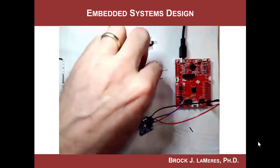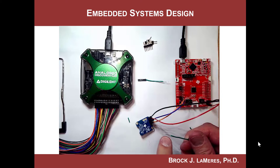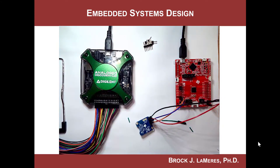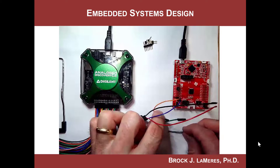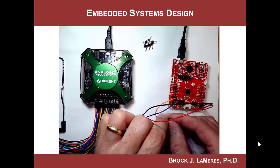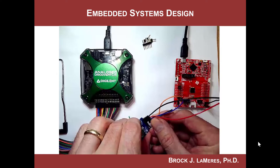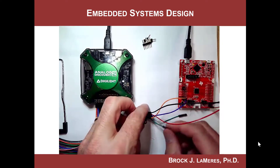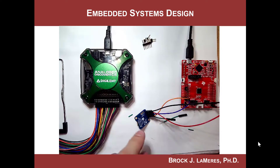Now I've got these two wires with their leads exposed. I'm going to plug them in along with the data and clock lines. Go ahead and twist the wires — they're actually multiple conductors — to make them a little stronger. Then take the data wire off the pin, plug the stripped probe wire into the female connector and bend it so it stays in the receptacle, then plug it back onto the pin. This smashes the probe wire in with the connector, giving me an access point to tap that signal.